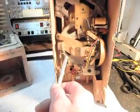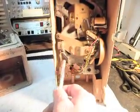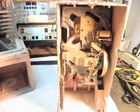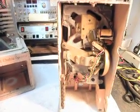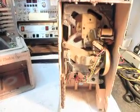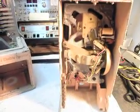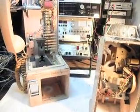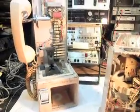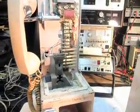We'll make sure that all the coins drop through and they ring the bell like they're supposed to, and the gong for the quarters. We're just going to have to go through all that. We'll pull the rotary out, go through it, make sure all the contacts are making contact and the numbers are racking off properly, and clean and rework the dial. As soon as our parts come in, we're going to get our vault door and our lock and our upper housing lock, and we'll get a card.